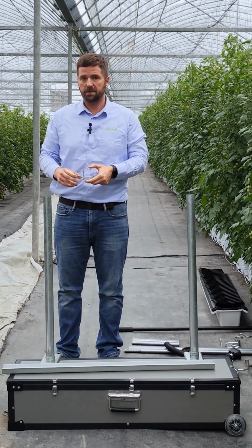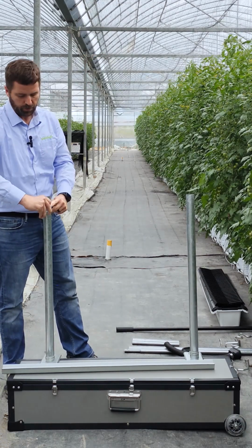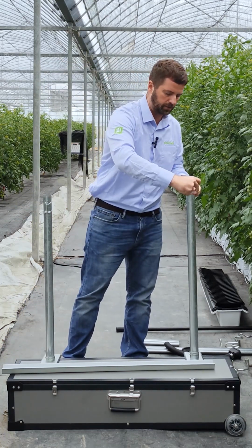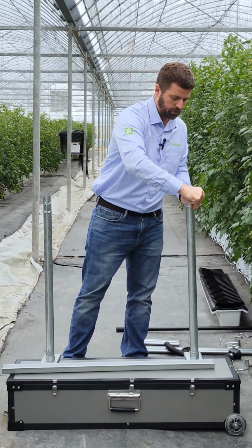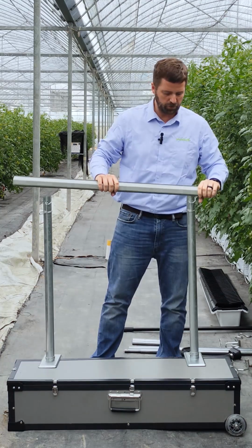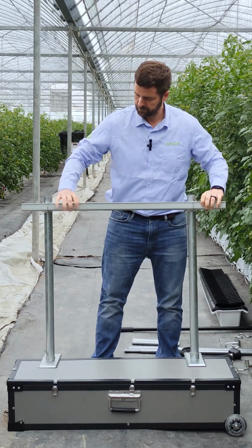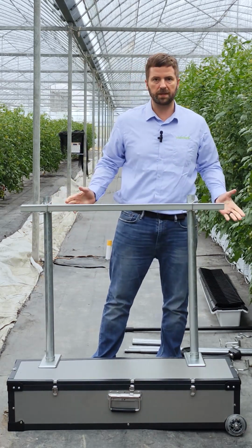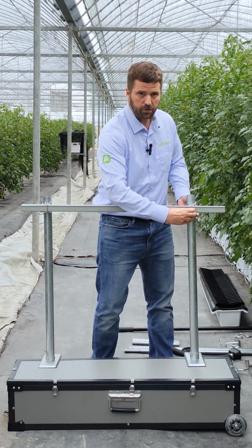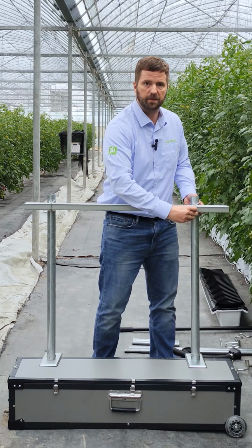The next benefit of the system are metal clips that hold on the gutter. All you do is slide the clip over the tube and it locks into place. This doesn't have to be done perfectly accurately the first time. You don't have to worry about the post sinking too much or changing later. All you have to do is snap the gutter in and it's in place. If you discover that the grade is set wrong, all you do is squeeze the bracket and you can adjust the slope and the height of the gutter.